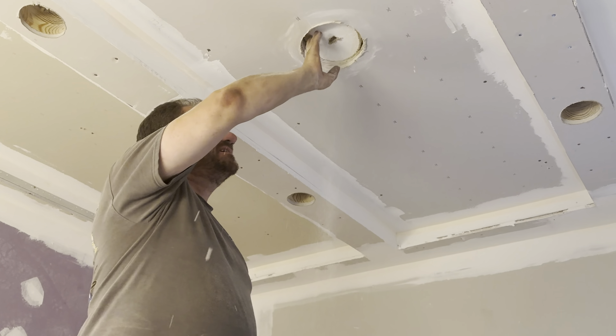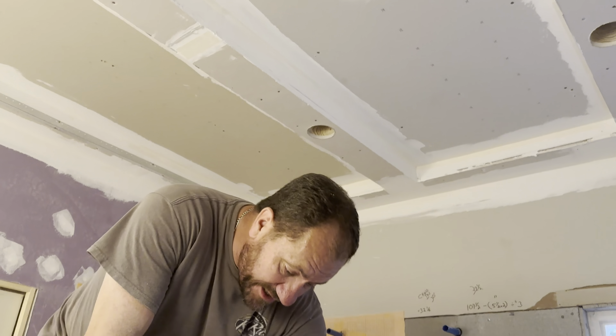We've got a can light here, a vent fan, and a wire that came from the vent fan to that can light. I'm going to go up in the attic, grab the vent fan wire, put it at the new location, take the wire off it to the first can light, then daisy chain from there to there to there. I'd rather do the connections down here where there's no insulation, dust, humidity, or heat — just air conditioning. And my wife is about to bring me a beer.